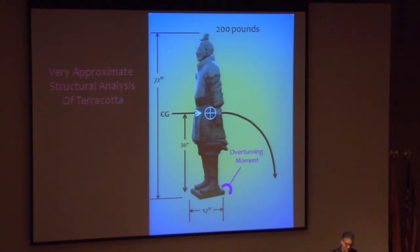They weighed around 200 pounds each and had a base roughly 12 by 12 inches. Even with our base-isolated building, a great earthquake would exert a tremendous force at the overturning moment or point of rotation. We say moment force is a force exerted at a distance — the tipping point of the object — and this estimated acceleration force would come from a maximum pulse of 0.3 G's during an event similar to the 1906 San Francisco earthquake, which was over 1 G.